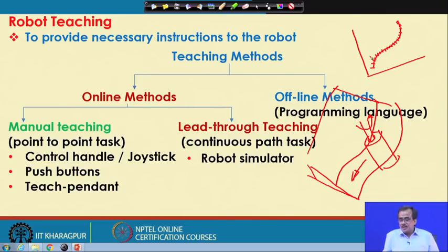For each of these 1000 or 1001 points, we cannot easily find the sets of theta values — theta 1, theta 2 up to theta 6. Moreover, once we have them, we will have to store these theta values, which requires a huge amount of memory. The more difficult thing is actually how to determine 1000 or 1001 sets of such theta values. Mathematically, it becomes very difficult to determine these 1001 sets of theta values, and that is why we will have to use some other practical method to collect this particular information.